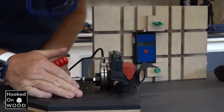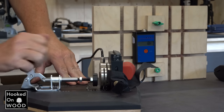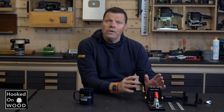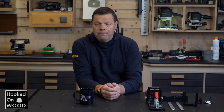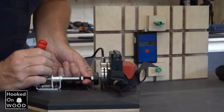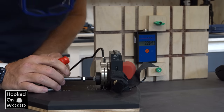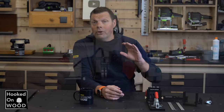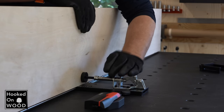And the clamping force goes way further than necessary. And I would even say it is too easy to create such a brutal clamping force. So you have to be careful not to create too much unnecessary stress on your pocket hole jig and workpiece. A clamping power between 20 to 40 kg is more than enough, and you can create this force by just turning it half or one turn. And I talked about clamping experience because it feels so solid and easy.